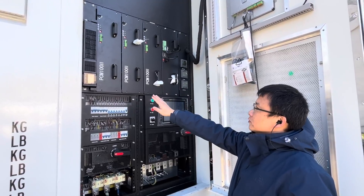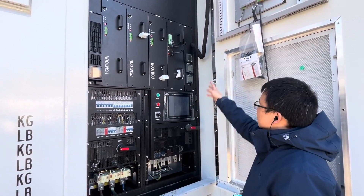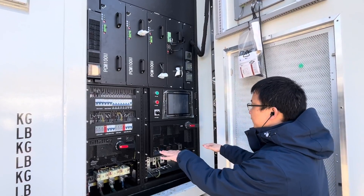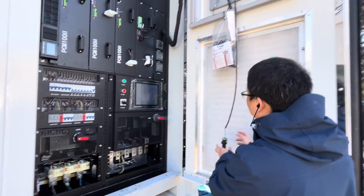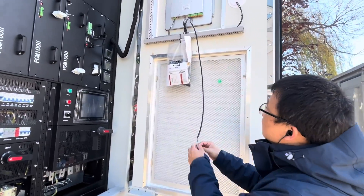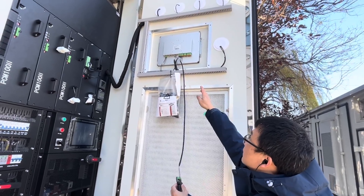Each of them is 100kW, and there is one UPS system for the control system backup. There are three clamp meters to monitor the current of the inlet and outlet. If you need extra controls, you can access all these parameters via RS-485 from this board.